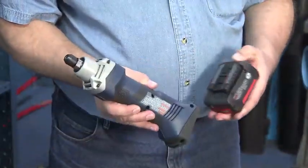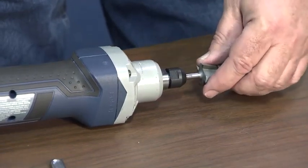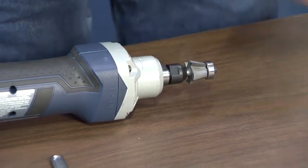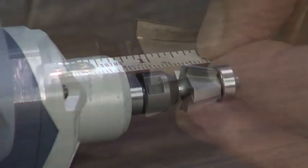Be sure the battery has been removed from the grinder. Place the RBIT1 router bit onto the grinder collet. Position the bottom of the bit's cutting blades 3/16 to a quarter of an inch above the top of the grinder collet, and tighten the collet with the provided wrenches.